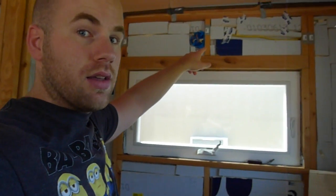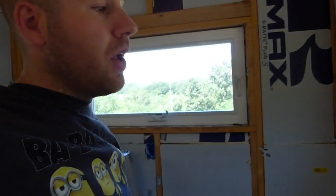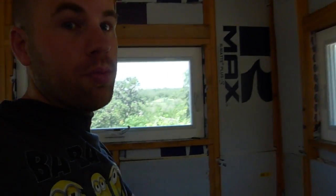The circuit goes up to the light up there, so I will be tying those together and testing them. And then I'll come down here and tie them together, et cetera. So I'm basically creating one big loop. Every time I get to the next outlet, the loop gets bigger, and then I test continuity to make sure that everything is connected just fine.